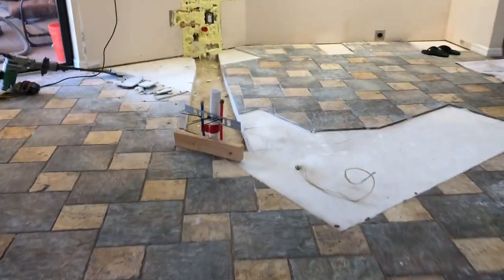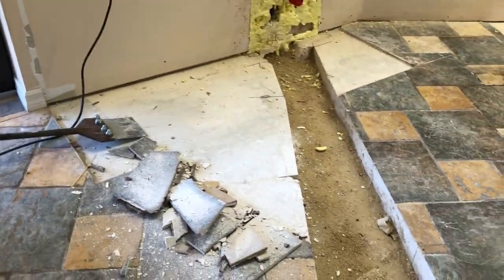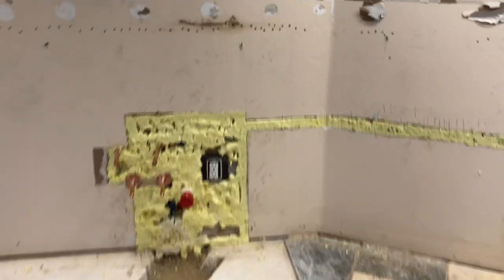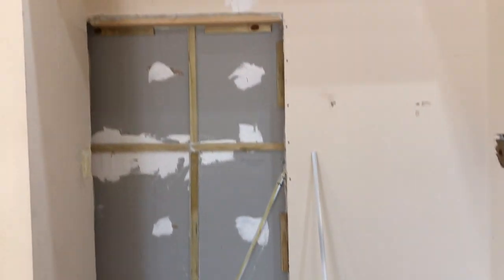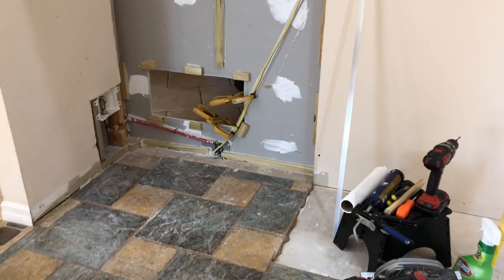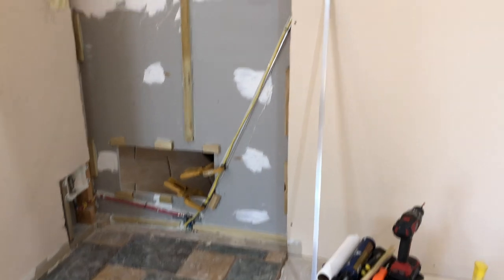Today's progress: I got the dirt back in here, started chipping tile — I'm going to rent a different machine because that might kill me. I've foamed all this in and cut the foam flush with the wall so the cabinets can go right over that. I've got the plumbing moved over, the electrical run up, some furring strips in here, and this is ready for quarter-inch plywood to just go over it. There will be about a one-inch pocket.